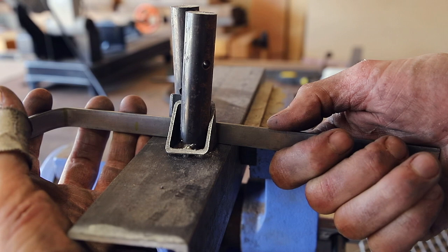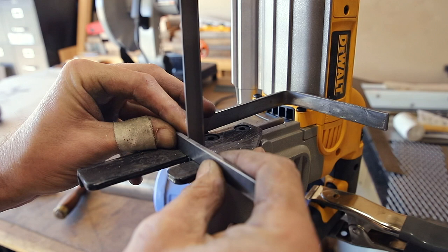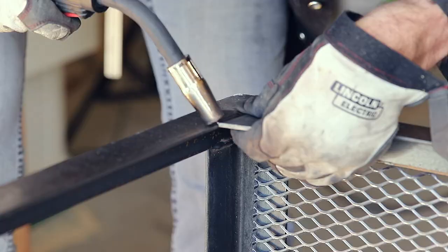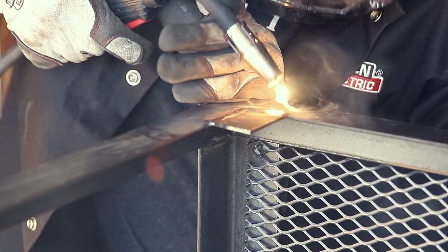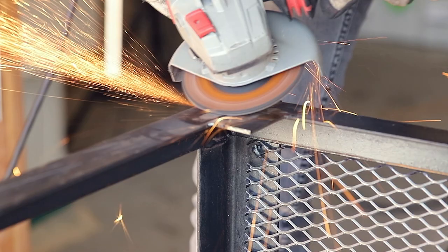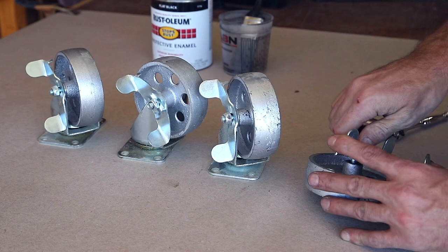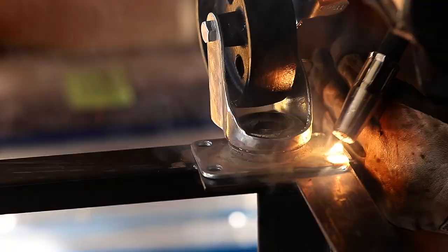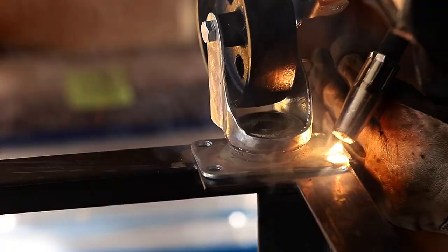I bent this half-inch flat bar steel, cut it to size, and then welded them in place. Before adding casters I had to weld on some flat bars to the corners so that the casters would be totally supported. I wanted sort of a vintage look for the casters but those can be really expensive so I decided to make my own set with the zinc plated casters I got online. I took them apart first and then painted the wheels black. Then I ground off all the zinc plating before welding them to the underside of the frame. I also wore a respirator while I was welding just in case I was welding through any leftover zinc.